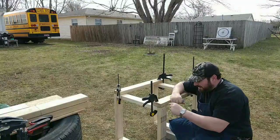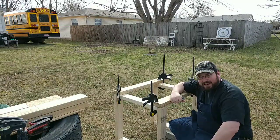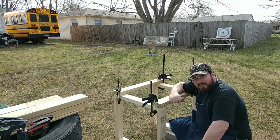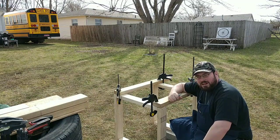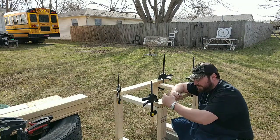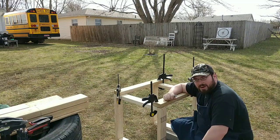One thing I went ahead and did before I clamped this, I added the wood glue and then clamped this into position to hold it. And also I got my concrete blocks, which is going to help me by giving it a solid spot underneath when you're working on soft ground. It helps with driving these nails in to have something hard on the bottom.